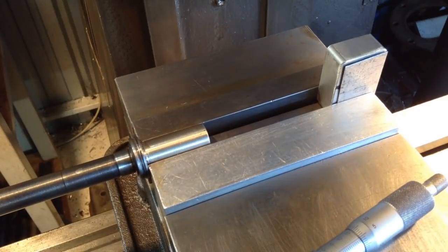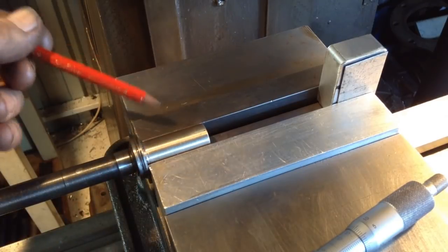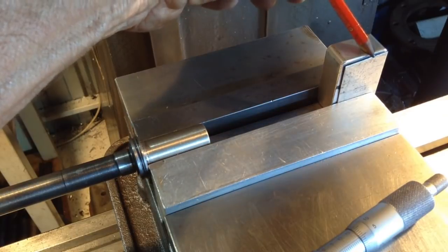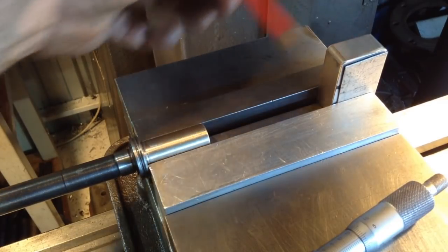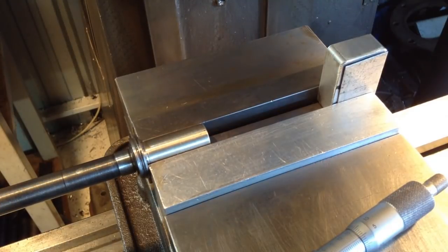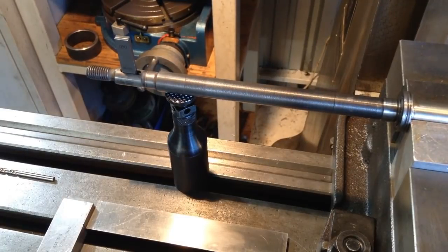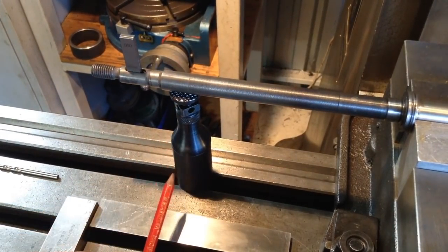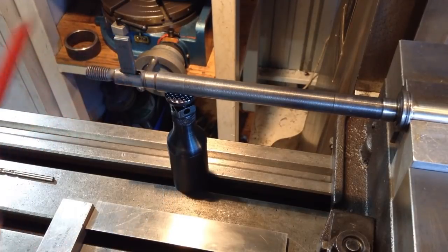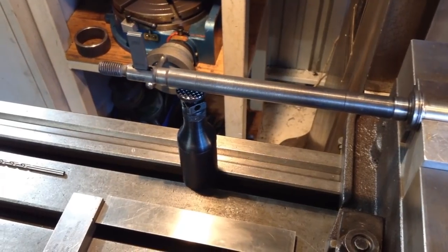So we have our shaft clamped in our vise now, and because we're only clamping one end, we have some blocks and some shims to make up the same thickness as the diameter of the shaft, so it's clamping parallel on the shaft. On the other end of the shaft, we've just got a Starrett machinist jack, and we've got a couple of gauge blocks set up here. And let's swing you to a different angle, we'll show you why.